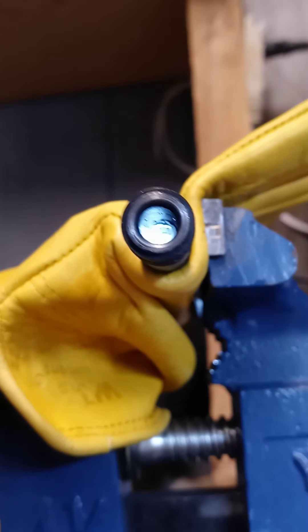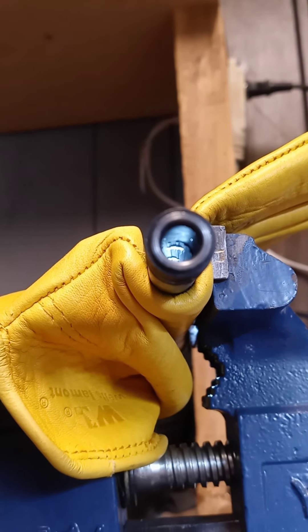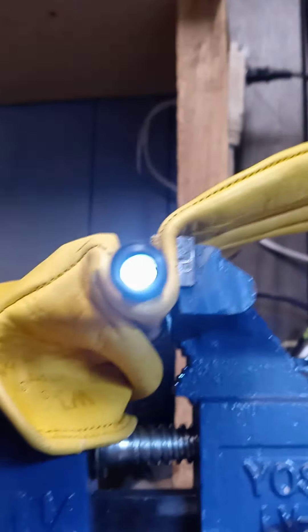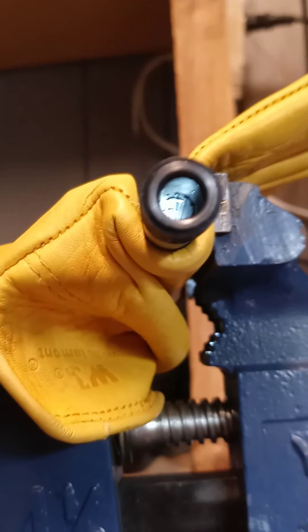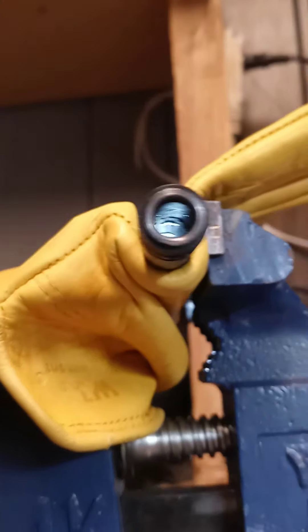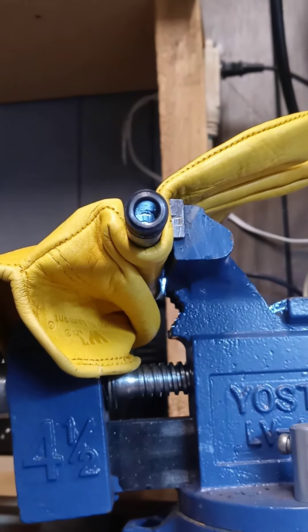What I have to do — normally the appropriate thing would be to have this re-rifled, but as you're probably aware, I don't have a way to re-rifle this. So the option and route I'm going is sitting here very patiently, taking my very sweet time, using micro files — very fine point micro files, nothing else, no dremels, no crazy tools. I'm going to try to go in between the grooves of the rifling where that lumped up bit is deposited right up here in the top, and attempt to wear that away a little bit and see if accuracy will improve. It's amazing the things you'll find if you really pay close attention — a good eye for detail always helps.